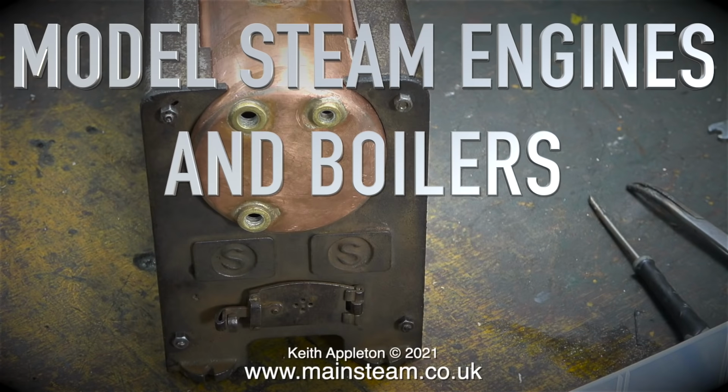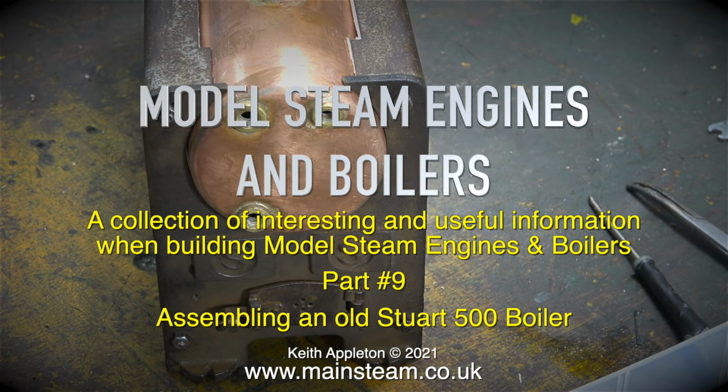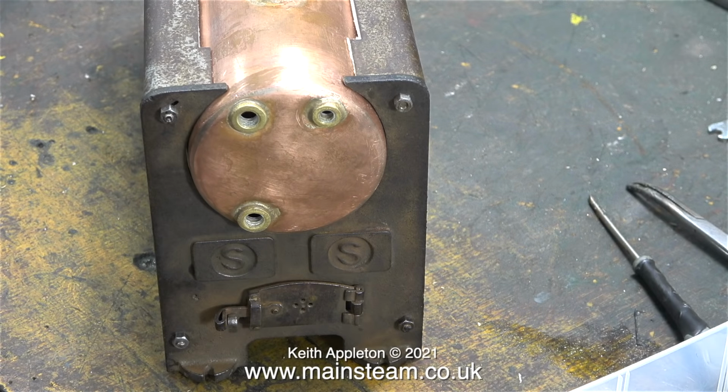Welcome to Model Steam Engines and Boilers, a collection of interesting and useful information when building model steam engines and boilers. This is part 9, assembling an old Stuart 500 boiler. If you follow my videos, you may realise that this 500 boiler was the one that had a very large dent in the side, which I removed by first annealing the dented area and then pressurising the boiler, and magically the dent disappeared, as you can see here.